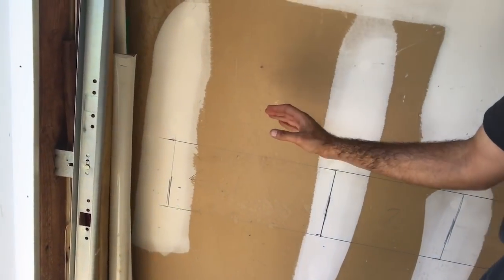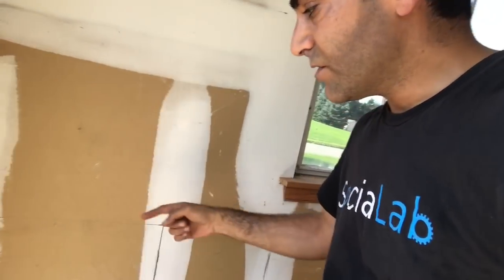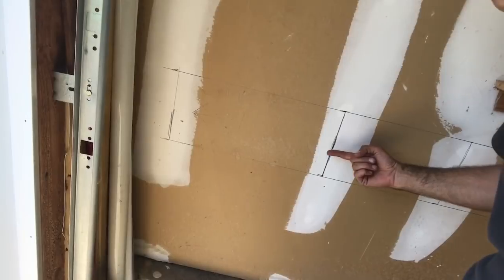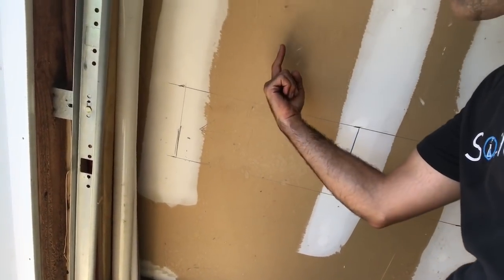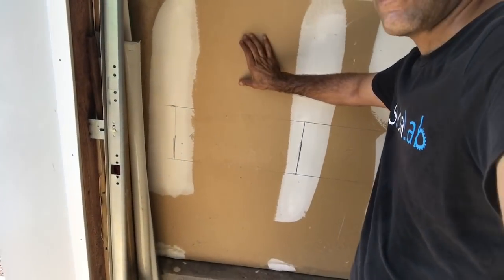I should add that I intend to put the outlet above my cut, because the box I'm going to put in doesn't really accept the wire to come through the side - it has to come through either the bottom or the top. The goal is to run the wire this way and then take a turn upwards through the bottom of the box, plus you'll have some room to play with. So the box is gonna go right about there.